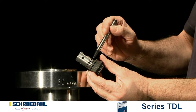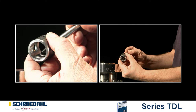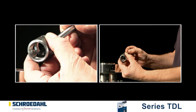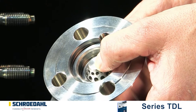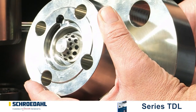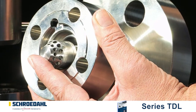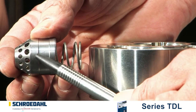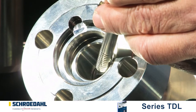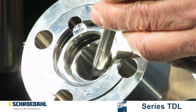Check the running surface of the control head for damage. Then examine the running surface of the control bushing. In the event of damage, the control head and the control bushing are generally replaced as a complete unit. Control the required movability of the bypass orifice and remove the bypass orifice from the bypass branch. Inspect the running surface for damage. Check the inner running surface in the bypass branch. If there is minor damage to the surfaces, you can re-grind them in accordance with the maintenance instructions.